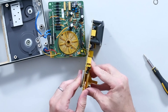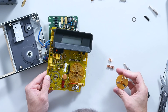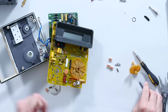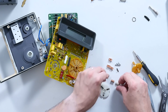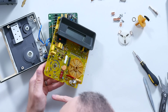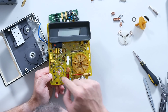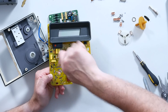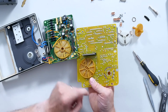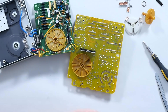But I will. Three contacts, three springs — and the same on the reverse. So three little bus bars and three little springs. You can see where some contact cleaner wouldn't go amiss — it's just slipped around this ring of inner and outer traces, depending on which pair is in which position. The front and back were actually locked together and did exactly the same on the back as well. Because there are three radially, you have the option of connecting or breaking up to six traces in any given position.